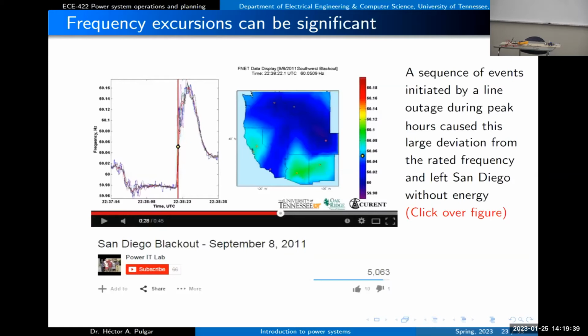And think that the power grid started more than a century ago. How come this is possible? We have this interconnection over the whole system. The reason why this is possible is that all the generators we use are synchronous generators. So they are all coupled together through the grid. The grid works at 60 hertz, and the rotation of each generator is proportional to the frequency in the grid. So they're all, in a way, coupled to each other. Whenever there is an increase in the frequency in the grid, that is sending a signal. If you measure the frequency of the grid locally, you have a sense of what is happening in the whole interconnection. So the grid itself acts as the communication system, the signal to control.